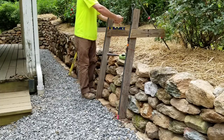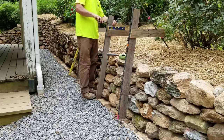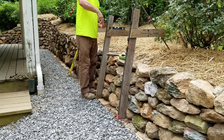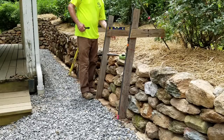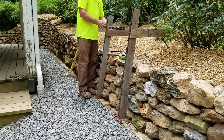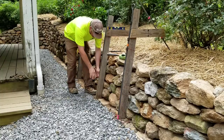Take your wire pre-cut, bring it around, spin it. I'll do two of these — one at the top, one at the bottom. If you make this fairly tight, it's going to stay there. The main reason for this is to check that it's level. It also gives me a guide to know the height of the wall when I get to the top — it gives me a sense of where to stop. Take your wires and fold them in or cut them. Make sure no one gets cut with them. Do the same thing down at the bottom — take that and loop it.